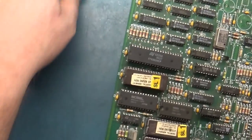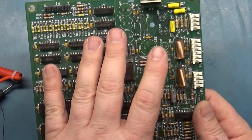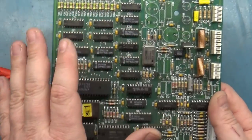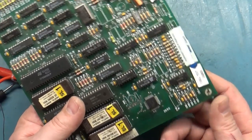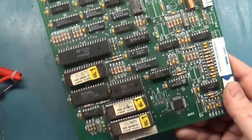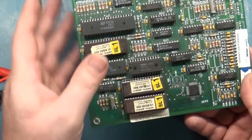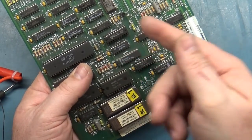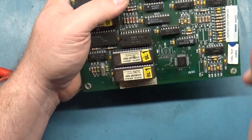I do not recommend using desoldering braid because of how brittle and frail these vias are. You will break and damage traces that feed these holes and vias very easily. So I recommend using a hot air station absolutely over this thing, on the wick actually, on these soundboards, because it's so easy to damage them by using pressure to try and suck the solder up. You damage the via and it lifts right off the trace. So use a hot air station like I'm going to show you in a minute. But